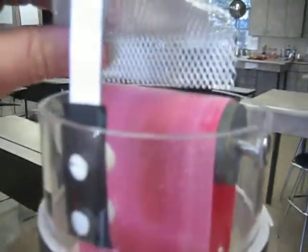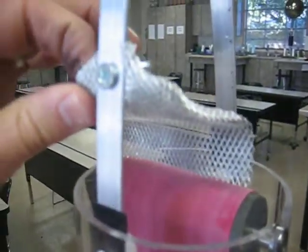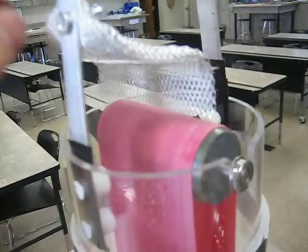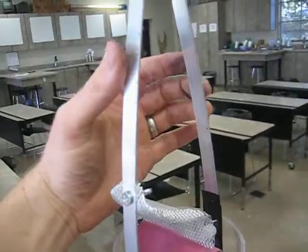Make sure the comb sits about a quarter inch from the belt, but the closer the better if you can. This is an aluminum comb, but the ones I am using now are all brass, as seen at the very bottom here. Brass is an excellent material for the comb — aluminum and copper become just a little too brittle over the course of time.